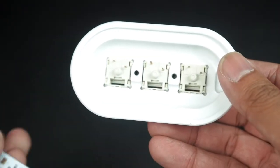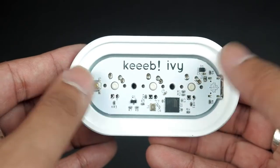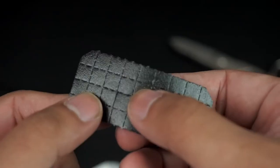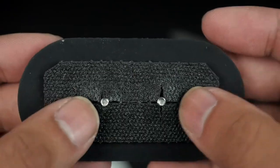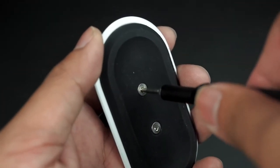The top plate is essentially an integrated one, so I'd recommend putting the switches in first, and then the PCB, so that the nipples can hang on to the PCB to keep it from sliding around when you solder. Something I like to do after soldering my keyboard together is fitting it with some foam. For this foam, you're going to have to put it on the base plate if you want things to fit in easily. But after the sound test, there was no noticeable difference with or without foam, so kudos on the design of this keypad.